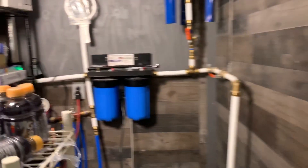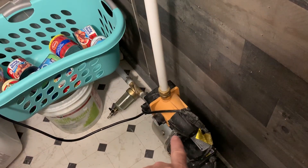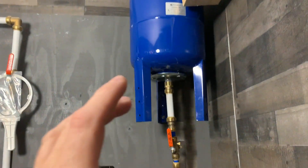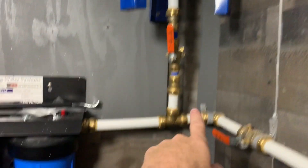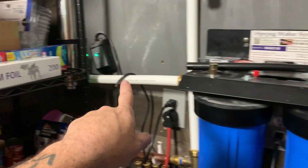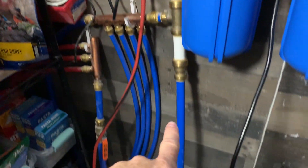Inside, we go to my little pantry water room. The water comes in at the bottom through a 50-micron screen, then goes to a three-quarter horsepower pump and gets pumped up — there's a shutoff out here. Then we have a pressure tank, about 40 pounds, which keeps the water from cycling on and off. There's another shutoff, then it goes into the big blue filters: a one-micron sediment filter, then a five-micron charcoal filter, and then into a UV sterilization tube.